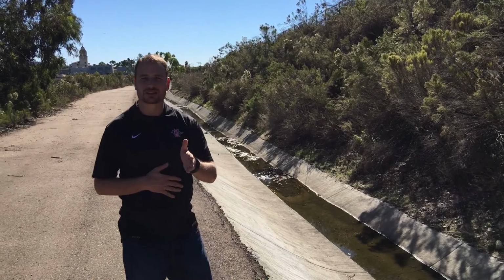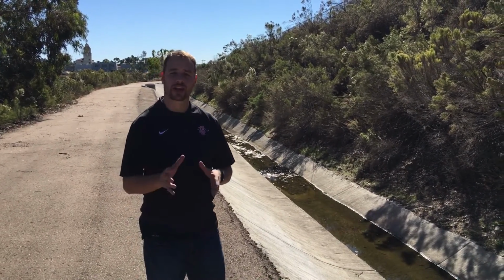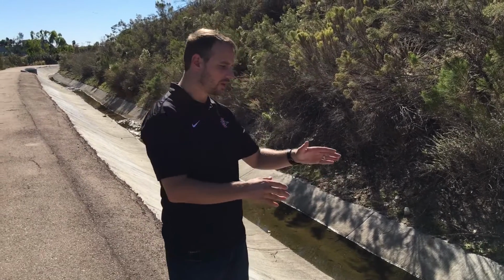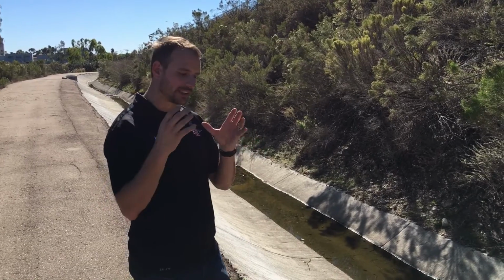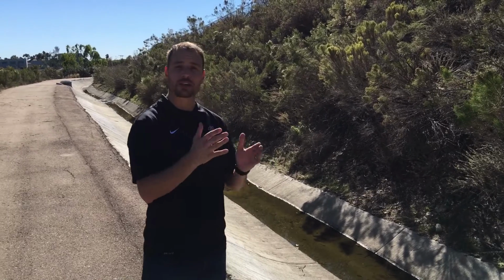So Scott just discussed the proposed site improvements. I'm going to continue on and go a little bit more in depth on the technology that we're going to apply on our project. The two water quality sensors are going to detect the water quality that is coming downstream from our watershed. Once the water quality sensors determine that the water is acceptable, the signal is going to be relayed to a control box, which is going to be on site, powered by solar power, and they have a battery charge to provide power to the slide gates, which are controlled by actuators.